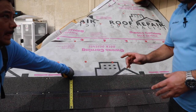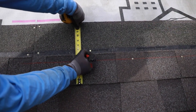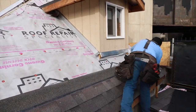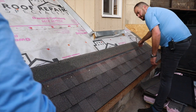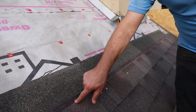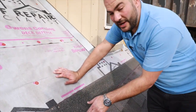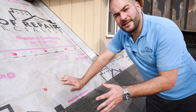The next measurement is where we're actually going to cut our opening. We want to go one chalk line at five inches and one at six and a half — that's going to be the width of our entire opening. Always make sure to come in six inches from your side, but it's okay to chalk out longer lines, then install your vents as needed. We made a small mistake here — we marked the first line at six inches, which we'll disregard, and the correct second line is at six and a half. So we want to cut from five to six and a half inches, and the easiest way is to cut the shingle, underlayment, and plywood all in one shot using a skill saw.